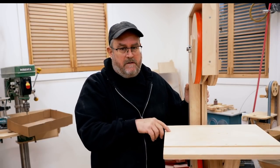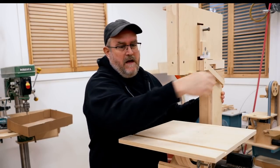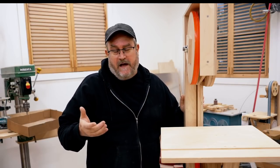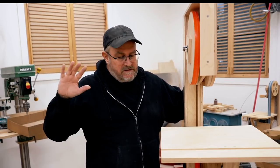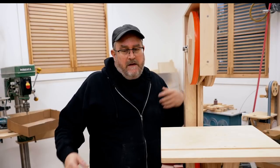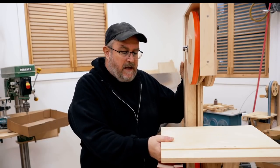As I said in that video, this was video number three. There'll be one more covering the upper blade guide, lower blade guide, and the cover, and I also need to make a handle for the tension — just a plywood wheel that the bolt fits into. I've had zero problem with tracking on this saw. I can change from a quarter inch to a half inch blade, adjust nothing — don't adjust the tension, don't adjust the tracking — and it tracks perfectly fine. That's probably a product of the blade length being identical, so if you have a blade that's slightly longer you'll have some adjustment to do.